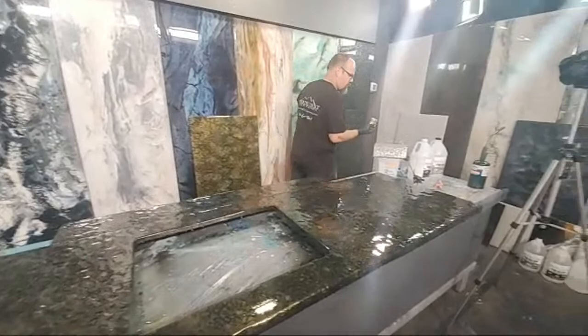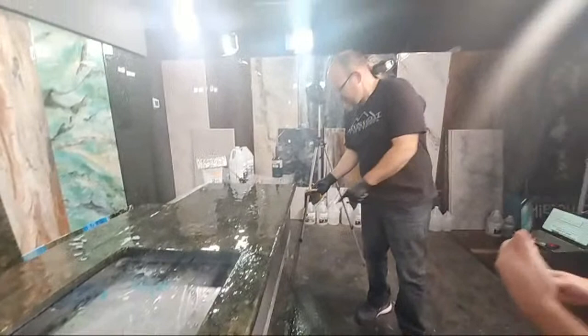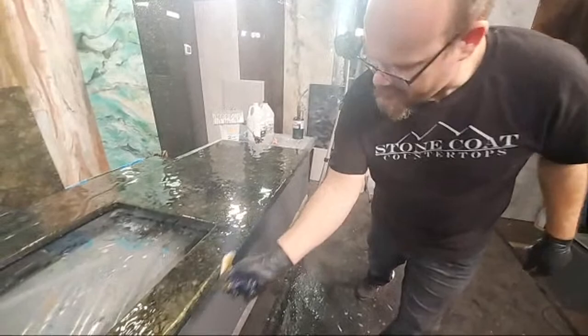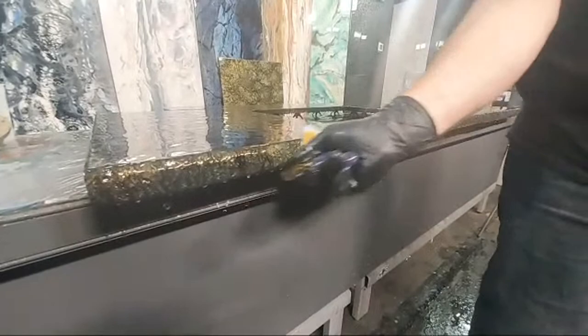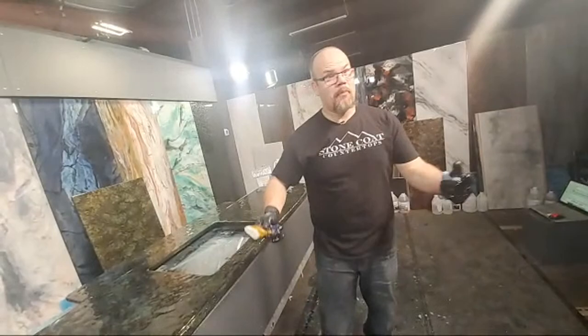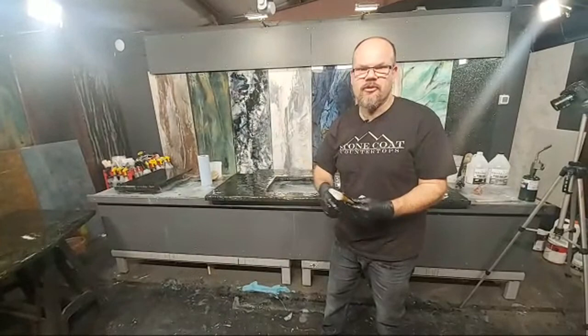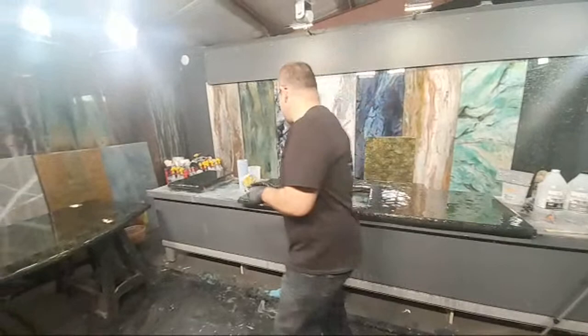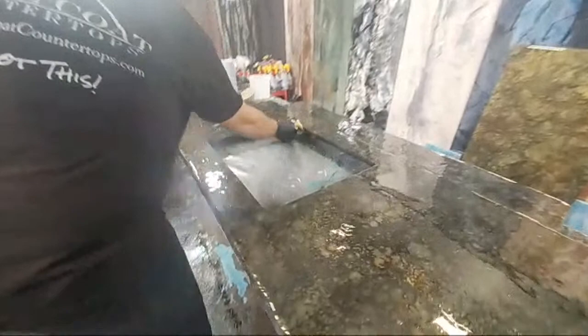I'm going to reach over here and get that front. Now that that's chopped out, I'm going to address these edges. I'm just going to take my brush in long horizontal strokes and brush these edges. Now, you see these drips under here? I could come here tomorrow and sand those drips off using a 50-grit metal sanding disc on my angle grinder. But if you were doing this on site, we'll come back in about four hours and use a tongue depressor to scrape that off. That works really well — but do it while it's gel, or else you're just going to keep coming back. When you apply that clear coat, it really adds depth and shows how good this thing is going to look.